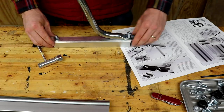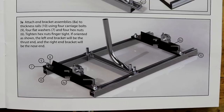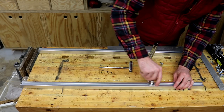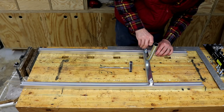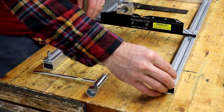The play in the parts by doing so will help you square up the mill when you're making your final adjustments. For attaching the end brackets and on-off rails, you slide carriage bolts into the thickness rails, which are aluminum extrusions. You then place and fasten the assemblies on the bolts. When you get to the point where you want to start tightening things up, a large framing square is the perfect tool.